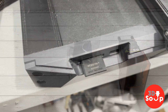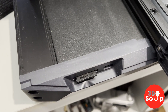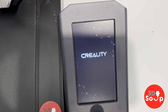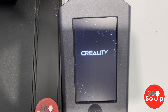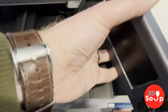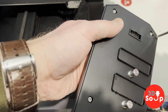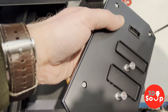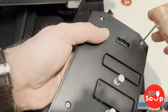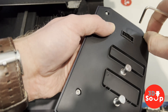I've put the new firmware onto the SD card and I'm going to load that into the printer, turn it on, and wait for the firmware to update. Updating the display isn't quite as simple as updating the board on the printer, but it's not too difficult. Instead of having an accessible SD card slot, you have to take the back off, unscrew it with the right Allen keys, put the SD card into the slot inside, reattach the printer, then turn it on and it will update automatically.